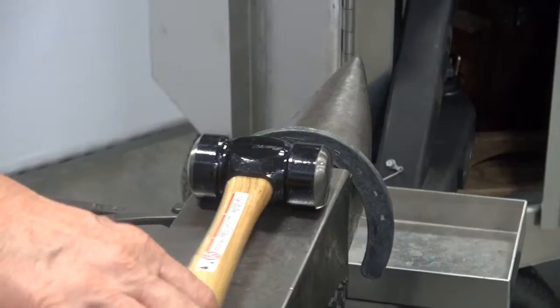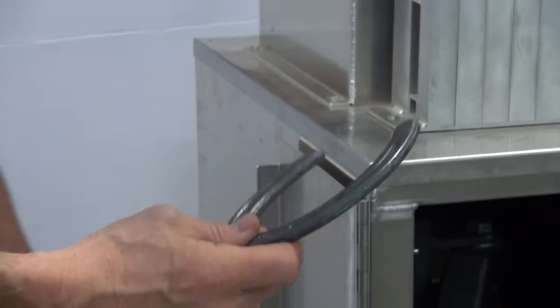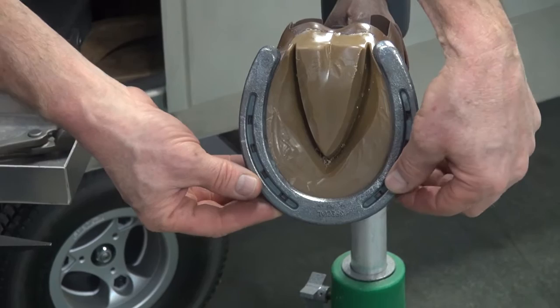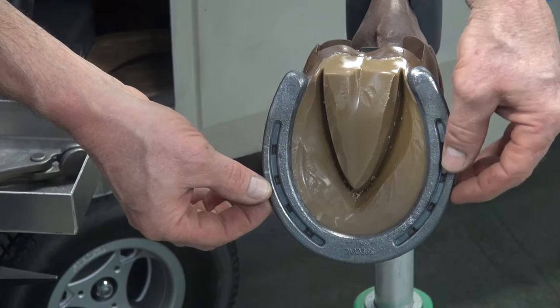I'll make sure that there's air space between the shoe and the anvil, hitting straight down, walking back and forth. I've now broadened that toe up. I'll check it with the hoof and then move on to the toe quarters. Using my fingers, I'm just feeling around there to see if it's the right shape. Right up into here, I start getting a little too wide, so I go by the nails at about two and a quarter.